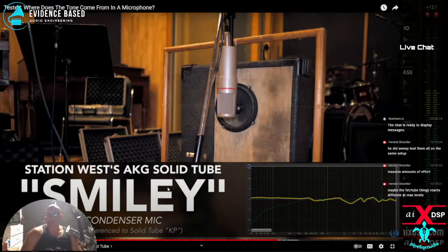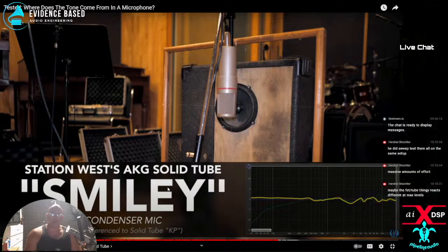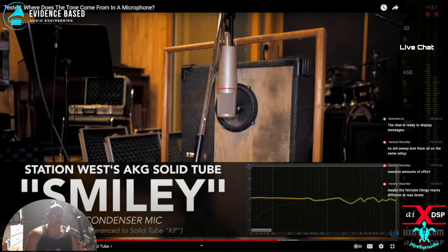Yeah, I would say that, Herschel, I wouldn't be surprised if, when you take the mic out of its linear range, they are going to act different. It's funny that you can get tubes and solid state stuff to pretty much distort the same, but I would expect that they're not going to, but by the time you distort one of these circuits, I think you're probably going to distort the capsule more than the actual onboard mic preamp. Earlier in this video, he was actually distorting these things on purpose, and I'm betting it was the capsule that couldn't handle it rather than the electronics.